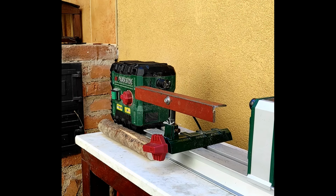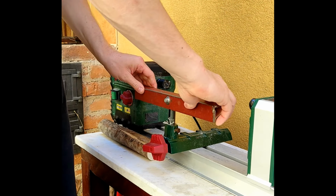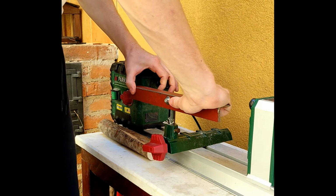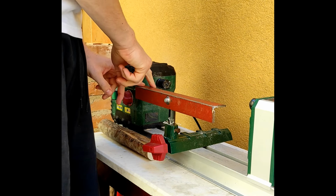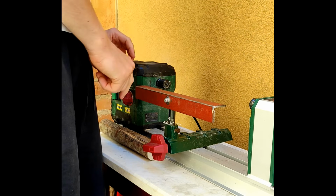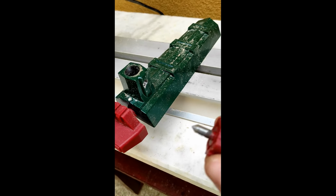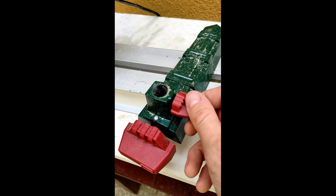The main problem with the lathe is the tool holder, which broke after a few uses. The first problem was its insufficient locking, where the holder was released during large vibration. Then the rotating holder could catch the workpiece, which happened to me a couple of times. The tool holder is only fixed with these plastic screws. As we can see, the screw is rotating.